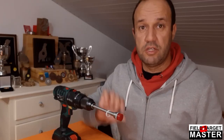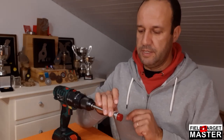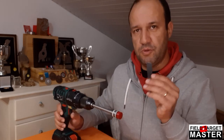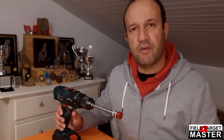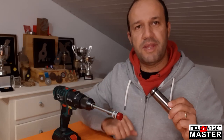So first, check the dimensions on the bearing, and then glue it in its place, and then, spinning this, with the sandpaper just get a little bit off, and let's see if after it's thinner it goes better inside.